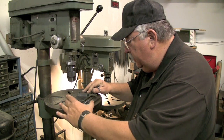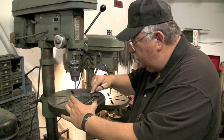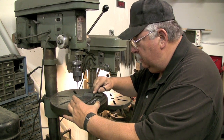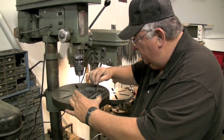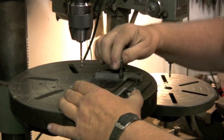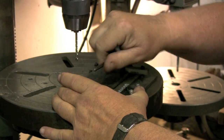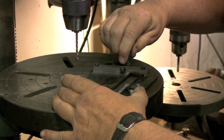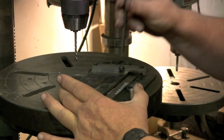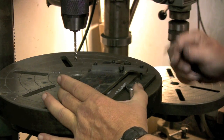We put the two pieces of steel in here and then we tighten these screws down so that the steel won't walk out when the drill hits it. You have to screw them down really tight — I used two screws in order to do that. You screw them down so tight that they actually bend this piece of metal, so we have this bridge to keep that from happening.